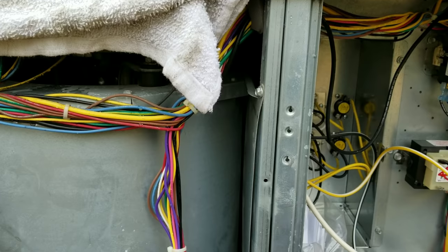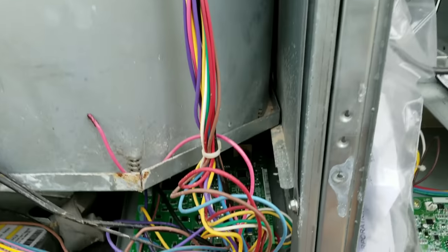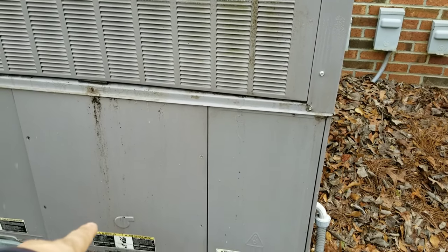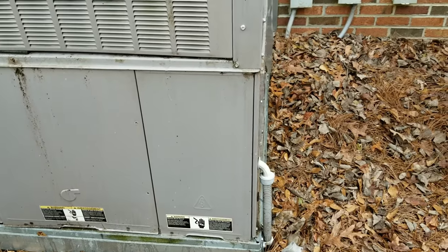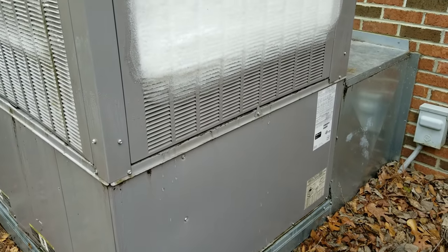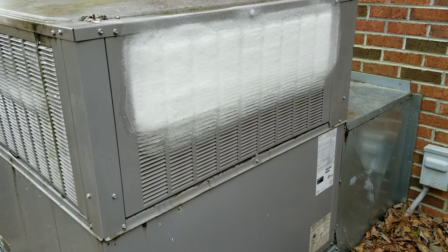My rag has started to get saturated with water and is now dripping, so I'm going to go get another rag so I don't get all the electrical wet. Terrible design. All right, we have everything in defrost now — I shorted those test pins and it's been in defrost for three or four minutes. As soon as I initiated defrost, all this water just pours down on those circuit boards and the blower, possibly ruining something that wasn't bad to begin with. So I went ahead, shorted the test pins, made sure it went into defrost, then buttoned the doors back up. We know our sensors are both good and our defrost board initiated defrost just fine. It's probably going to terminate on a 10-minute defrost instead of terminating on temperature, just because of how much ice is on this unit.